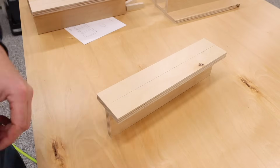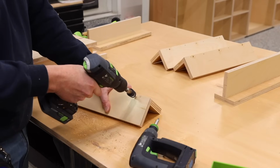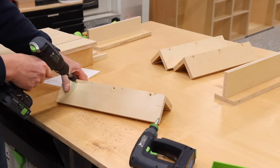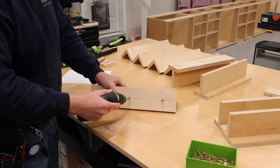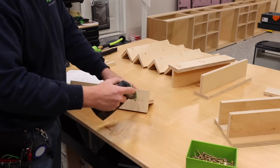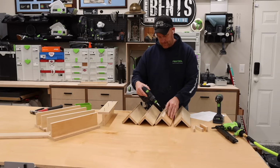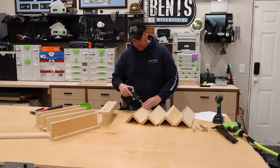The materials that I use are typically just scrap plywood that is left over from whatever cabinet project I'm working on. I don't use any glue, and I only assemble them by first using a narrow crown stapler to hold all of the pieces together until I am able to pre-drill and drive some screws in to hold everything tightly together. These don't need to be overbuilt, as they are just a platform for boxes that will then be attached to the studs in the wall.